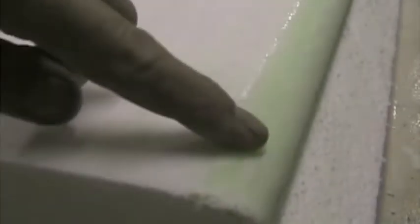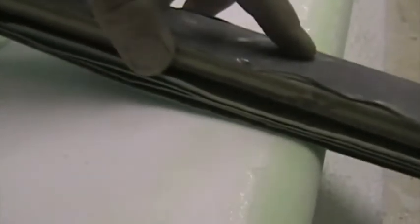After ripping out the peel ply, I've sanded this to a gradual gradient onto the glass here. The leading edge has been roughened all the way down, and this edge of the glass has been beveled off using a block. Pretty much this angle, you bevel it off so that you won't feel a step in the glass here, by at least 25 mm, preferably 40 mm, all the way around, and it's been roughened up to about there. I've cut away a bit of the foam here to allow the glass to go around and not foul with this bottom foam. The bottom surface is now ready for glassing.